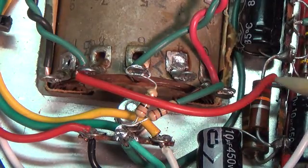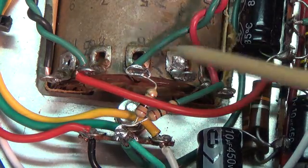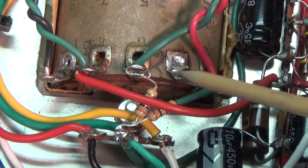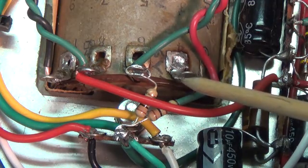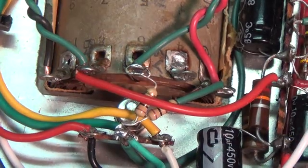If you didn't know about that, now you do. On any of your amps that are humming, check the 6V windings on the filament transformer. See if you have a center tap — if it's grounded, then your hum is coming from some other source. If it's not grounded, ground it. If you don't have a center tap, create a virtual one with two 100-ohm resistors.